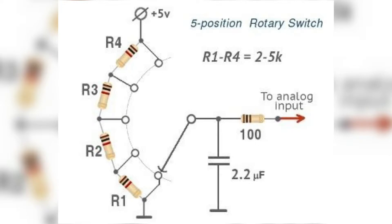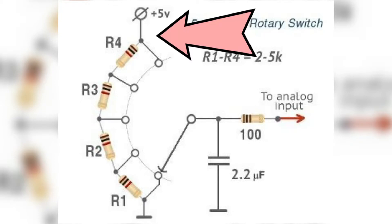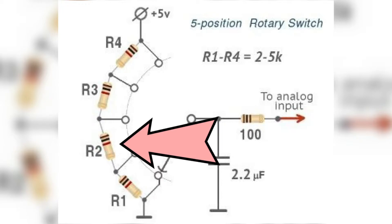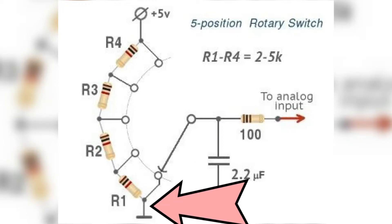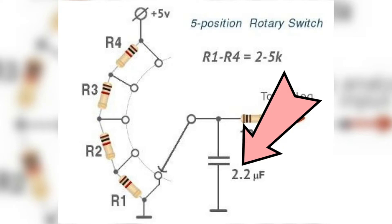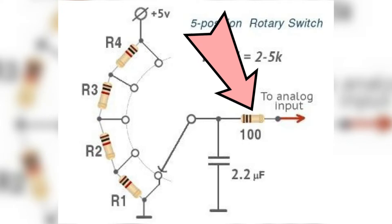So instead, here's what we're going to do. This is a five-position rotary switch, and you can use the same logic for a 12-pin or 24-position rotary switch — it just adds on and multiplies as you go through each of the resistors. We're going to have 5 volts at the top connected to the first position, then a resistor bridged between each position all the way to the last, then ground. Off the selector pin on the rotary switch, we then have a capacitor connected to ground, and a resistor which connects from that selector pin to the analog input going to the Arduino.